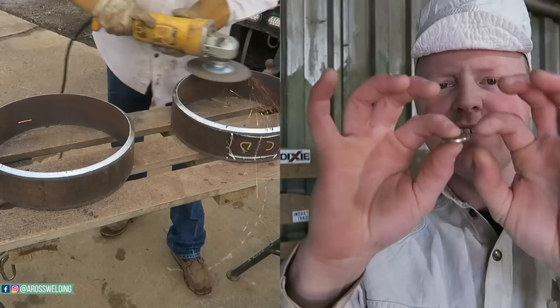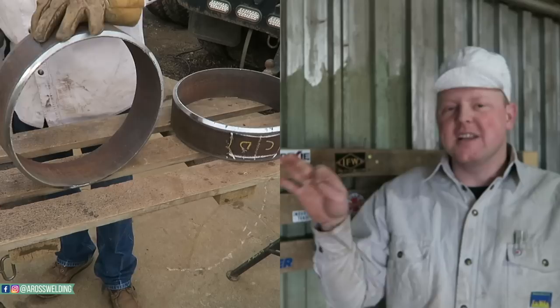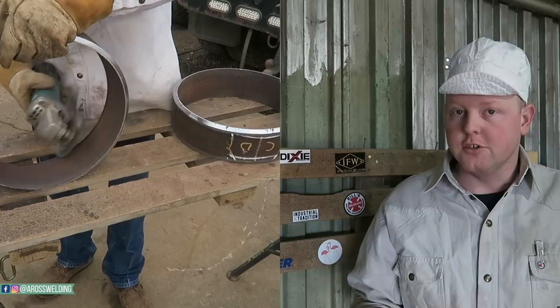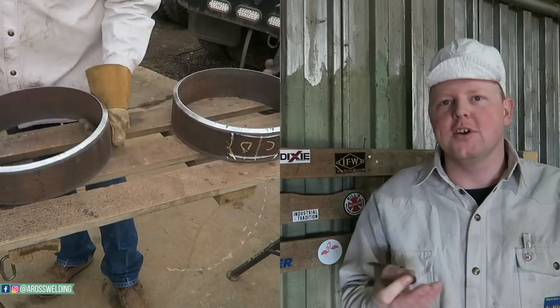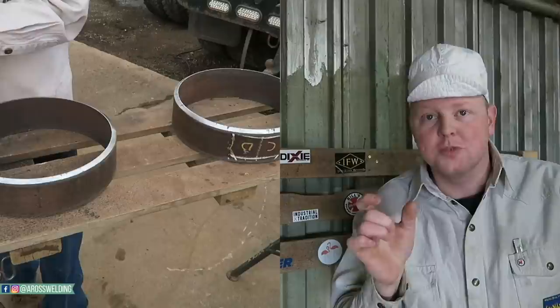It's about perfect really, depending on what size of pipe you're welding on. But I'm actually putting on a little bit less than a nickel right here, about a 16th, and then I'm gonna take a little bit less than a 16th of a space, but I'm also running a 1/8 bead rod. If you're going to be running a 5/32 bead rod, you might want a nickel or heavier and a nickel or more space. That is a good rule of thumb, but it all depends on how you weld, how you were taught, how hot you're running, how thick the pipe is. That makes a difference too. But just keep in mind, the more landing you have, the thicker your landing, the more space you're most likely going to need. So that's the rule of thumb on landings.